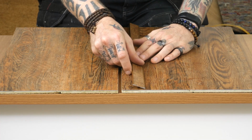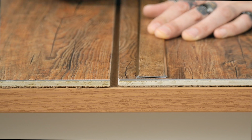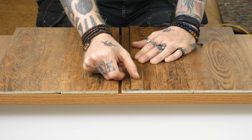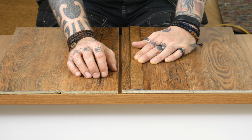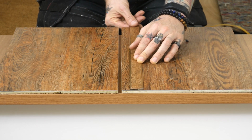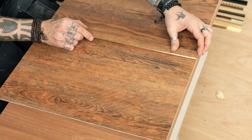It's also available in the 1mm recess. This is designed for your rigid tile with a peelable surface. Again, you can install the flooring into the trim, giving it 100% colour match between the floor covering and the profile. So there's no need for aftermarket trims anymore, which only slightly colour match at the best of times. Make sure you leave the appropriate expansion gap required.